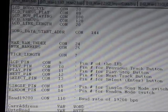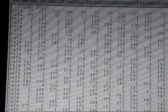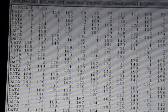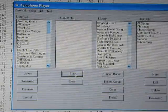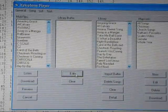Finally, the software. Controlling the activations and timings of the solenoids is a microcontroller program written in PBASIC. The program reads a series of data bytes stored in memory, each of which corresponds to a command to strike or release a mallet, or to pause a certain length of time. However, it would be extremely tedious to program every single note into the stamp microcontroller. My solution was writing a Windows program that can convert a MIDI file that I find on the internet into the series of data bytes.